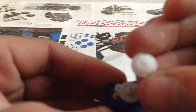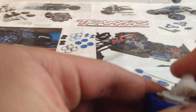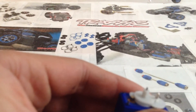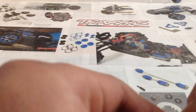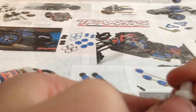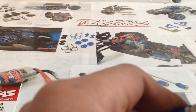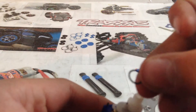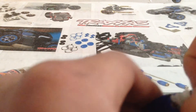Get your big gear — you'll notice it has a little notch in it. Put the taller side of the notch facing the little center gear that we just put in, and then push that down in there. It might be kind of hard to put on there; just slide it down. Then get your little circular black washer and put it right back on top, just like it was on the other output gear.